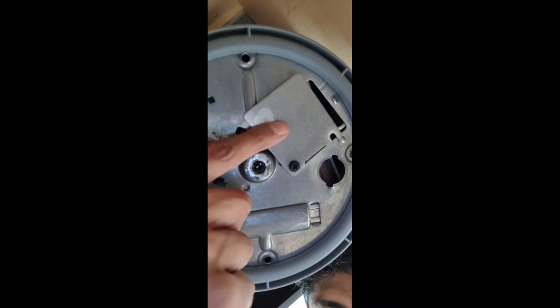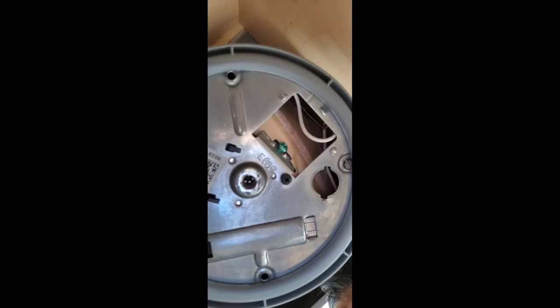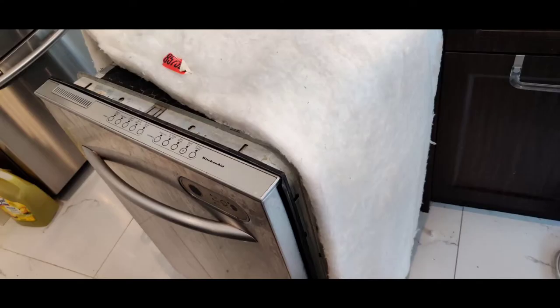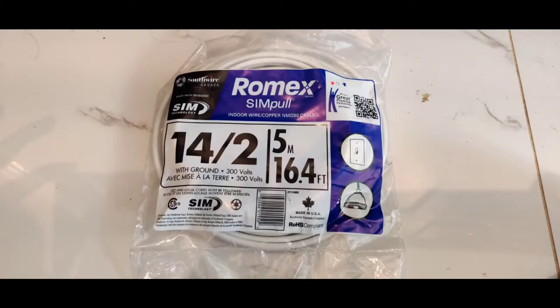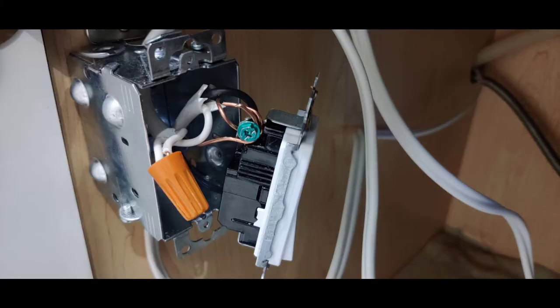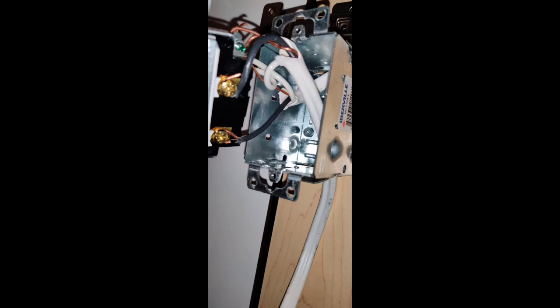Now we start with the electrical by opening the small plate under the disposal unit and pulling all the cables out from inside — it's pretty easy. I took the electrical feed from the dishwasher, which is very close to my sink, and ran the cable from under the dishwasher through a hole in the back and into the disposal unit. The switch and all fittings I got from Home Depot — it's very easy to install.